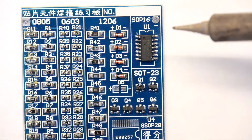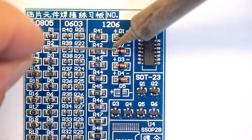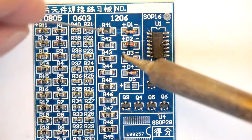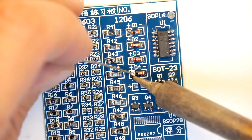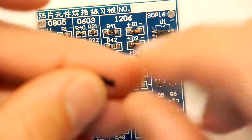You don't really see these so much in things anymore. But if you look at an old telly, CRT telly, you'll find some of these old diodes like that. Now that one was not behaving. So make sure your soldering iron is really heating the junction between the two things. You want to try to heat the pad and the component at the same time for best results.